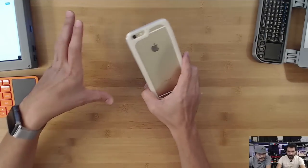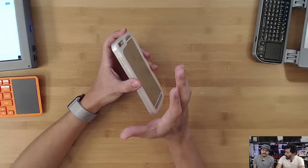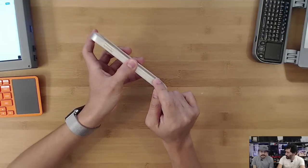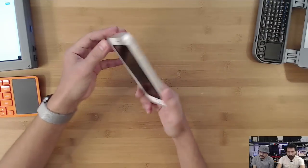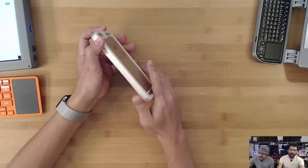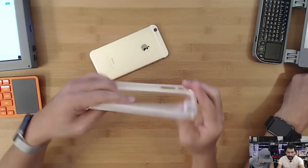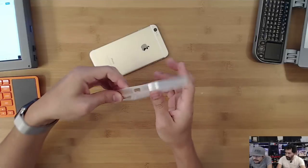We did a video on the differences between that, but real quick, it's a lot higher resolution than the regular Ninja Flex. So you could do bevels and overhangs a lot more cleanly than the regular Ninja Flex would. It also has a more slippery feel, so it makes a great bumper case, it'll just slip right into your pocket. And of course, it's transparent, so it's very good for light diffusion projects. And you can tell here, it's definitely a little bit more sturdy, and it should work better on direct drive extruders.